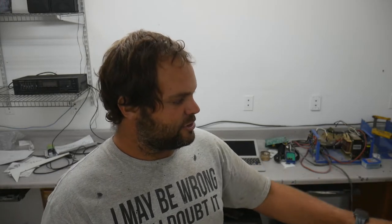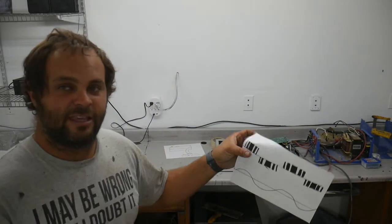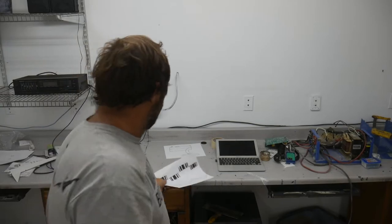Looking at that, I know it doesn't look that good. You look at it on a scope, it doesn't look that great. You go through a transformer, you go through a couple inductors, some caps, it does filter this out and make this look smoother. But in my experience, or my understanding, it works great. A sine wave like that drives electric motors extremely well.